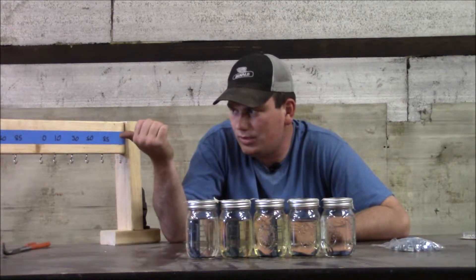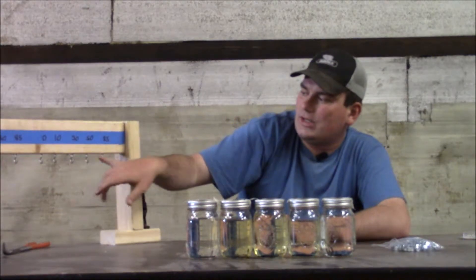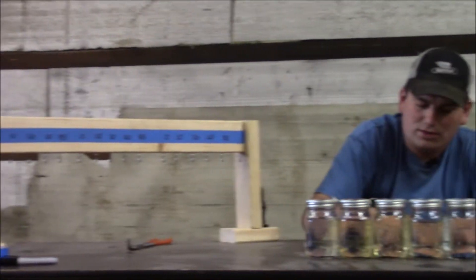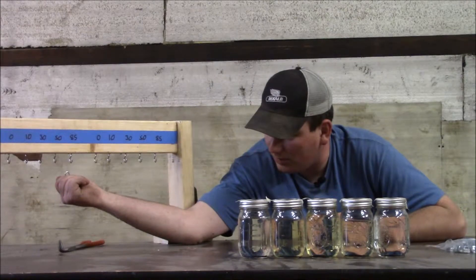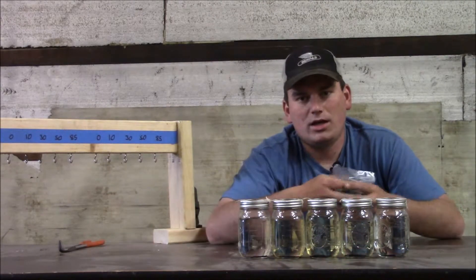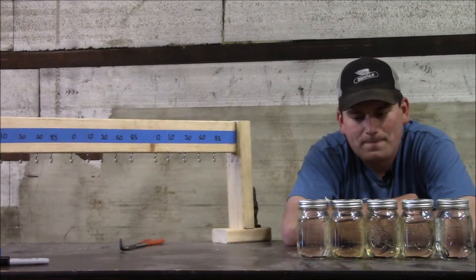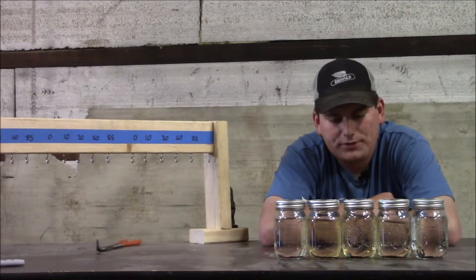I have this hanging board here with the different blends. Identical pieces of the kit will be placed next to each other for each blend. I will take an S-hook and hang it off of the O-ring or gasket, then hang a bag of 3H nuts from them. We shall look at which one hangs the lowest — which one is damaged the most. These are all soaked equally, so we shall see what fuel damages them.